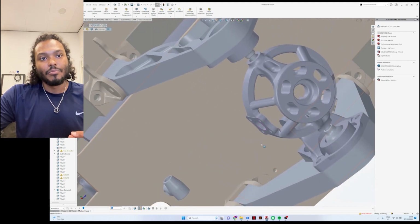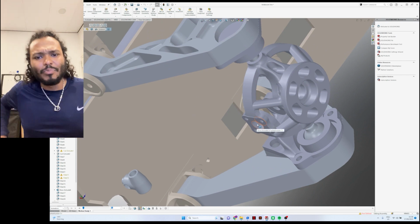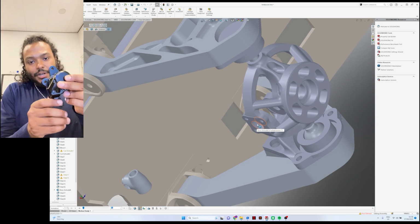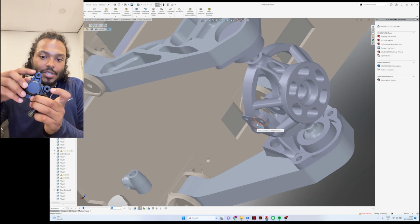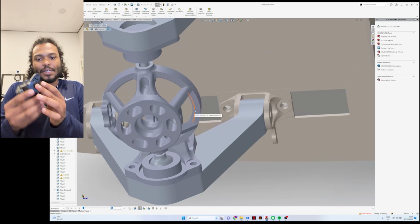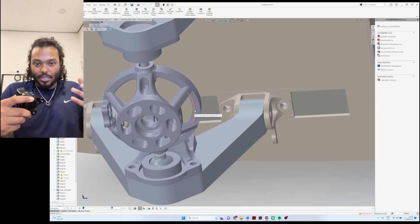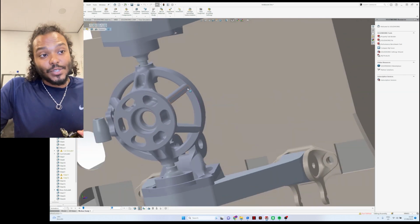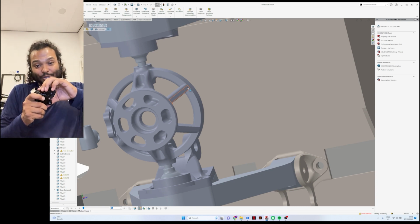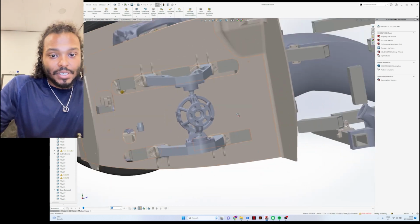This is the extra modification that I made for the steering rack, so that I can also attach another ball joint. Let me actually get that part. I have 3 parts that I could show you guys some stuff with. So this right here is the brake caliper. This will sit with these two components that need to attach right here to the wheel joint, because then they will have the ability to stay stable on the wheel carrier. But as soon as you press the brakes, it will squeeze the brake disc and maintain its position. But this will need to be extremely strong while it is 3D printed to uphold its position while the brake forces are going through it, trying to drag it up with the rotation of the wheel. So that is something that I do need to pay attention to still.